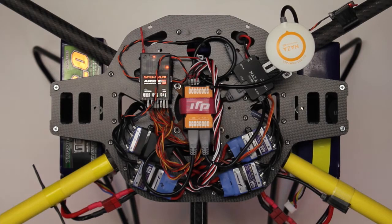What we're looking at here is the installation of the Naza V2 on the frame of my helicopter. The DJI system is a modular system — you have different components that all interact and attach to each other via wires, so that when it's all put together it makes up the entire flight control system. It takes into account power management, a way to communicate with the pilot, and some potential for expanding later on via the CAN bus system.